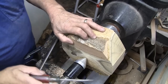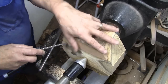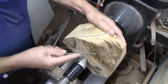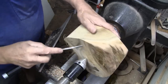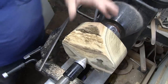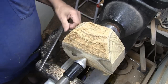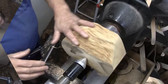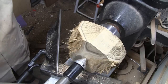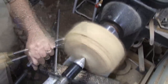I have it on the worm screw. Let me show you why I didn't even consider making this a natural edge bowl — you can see this line right here. I knew that this was going to fall off; it has a tendency to do that. That one's on a little better but it is going to come off as well. That's okay, it just helped me get a shape on here. I just sharpened the 5/8 bowl gouge and I'm just going to start rounding it to get it into balance. We're doing about 700 RPM right now.